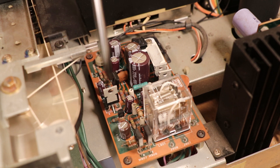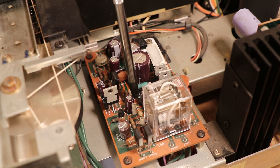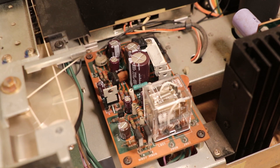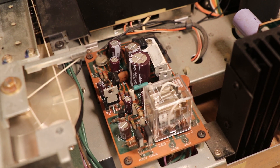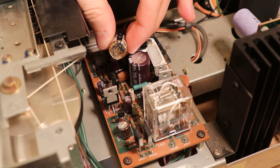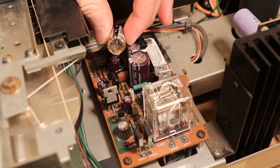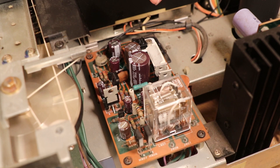I replaced every single semiconductor on this board because I can over-spec it, over-build it, and make it even better than it was when it was new. I know that all these capacitors are a lot better than the originals and they'll last longer — that goes for these common cathode diodes, these transistors that help out with the relay, and all these other transistors around here too. In any restoration it's proper to replace the capacitors, so we replaced every single electrolytic capacitor on the board with a Nichicon PW series capacitor. This one right here was especially good to replace — this thing used to be on this circuit board, and you definitely don't want that. I honestly don't know how this thing worked with that cap in the board, but it was. We also replaced the zener diodes and the normal diode, and put new thermal compound down around H804, the TO-220 transistor — parts list in the description.